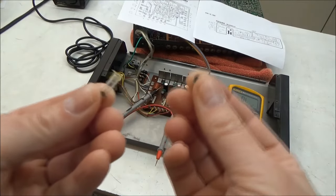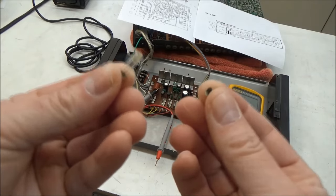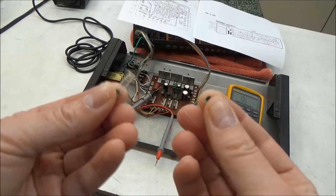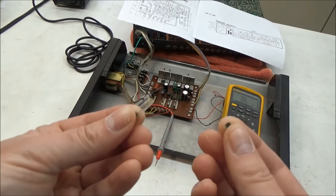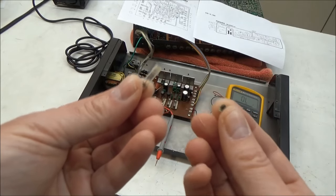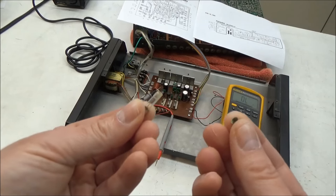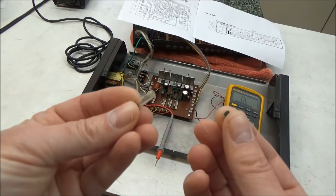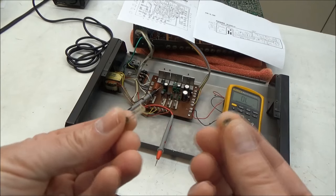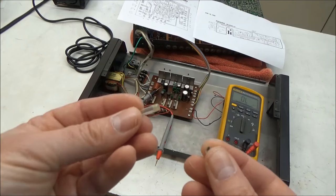Don't use cheap fuses you buy on Amazon or eBay or other places. Always use brand name quality fuses sourced from the manufacturer's authorized distributors like Mouser, DigiKey. Fuses are circuit protection and can protect you from injury or death and can prevent your home or studio from catching on fire. You don't want the fuses falling apart like this one, and you also need to be confident that they're actually going to blow at the specified amperage.